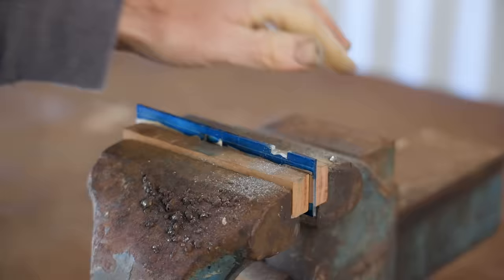I'm grinding the head ready to knurl, but I didn't get the head on very straight. I kept going with it, but it ended up well off center and I just wasn't happy with it. I tried to remove the head by heating it up to melt the solder, but I managed to break the screw. I made another screw, but I went about things differently.